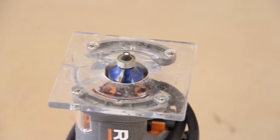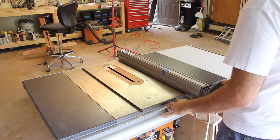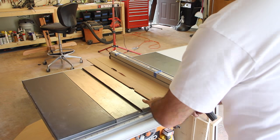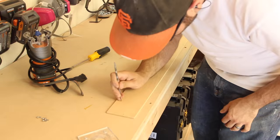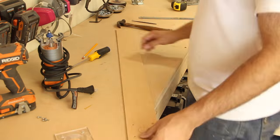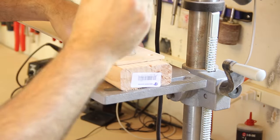The top needed to be cut into a 48-inch circle and I would use a router to get the job done. To make a quick circle jig I cut a scrap piece of quarter-inch plywood into a three-and-a-half inch strip. I removed the stock router plate and marked the screw holes on my board. I drilled and countersunk so the screw heads wouldn't interfere with the operation. I also marked out the center hole and cut it out using a Forstner bit on the drill press.